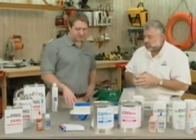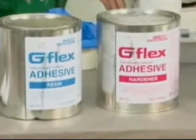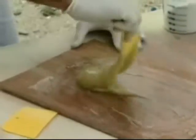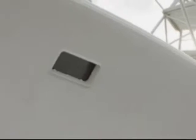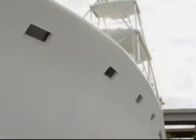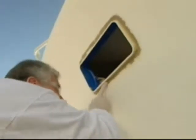For this particular job, I would recommend G-Flex. G-Flex is a structural epoxy that's somewhat flexible — it's designed to bond dissimilar materials together. It would be perfect for this plastic. Here's my challenge: these port lights are actually mounted into the area of the boat on the Monterey where we have a bow flare — it comes up at a weird angle. They're literally going to be kind of hung in a suspended fashion, and I don't want any material oozing out. We've spent a lot of prep time getting this ready for paint, and I need something really thick that's going to hold and not sag.